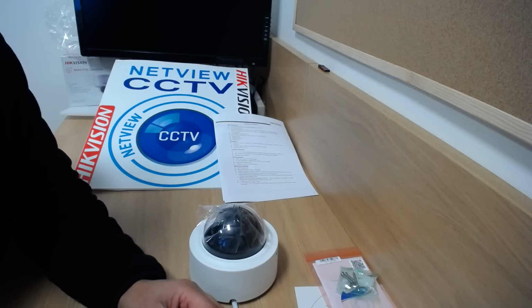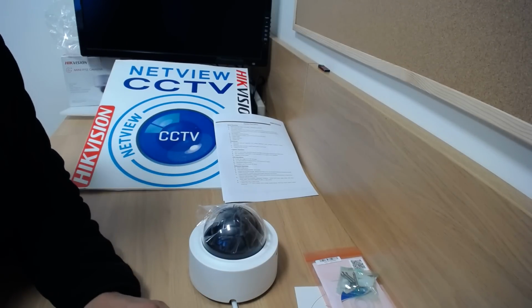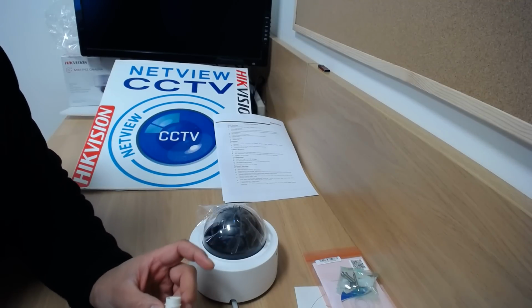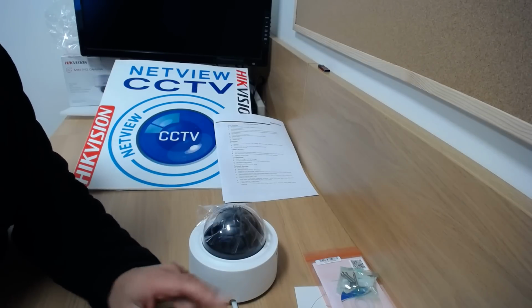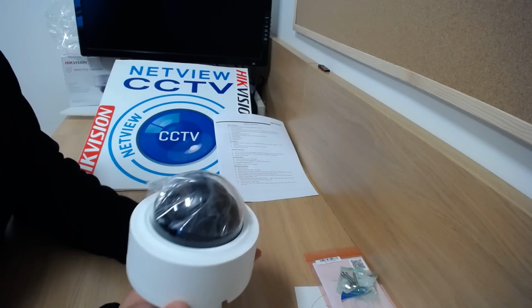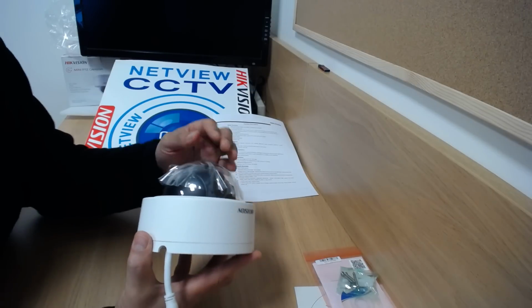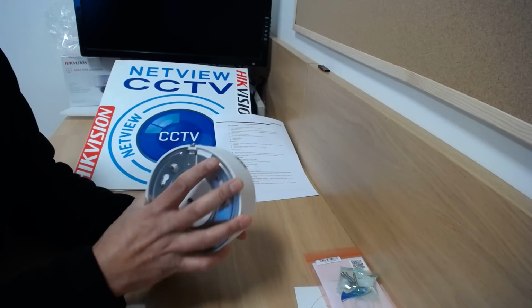And also a 12-volt power supply. The 12-volt power supply is if you don't use the PoE and just use the RJ45 for data. Connect, for example, into your network or into your router, then just power the camera separately with a 12-volt power supply, and that's all your connectors on the back. It is IP67 rated, so don't go opening the camera up itself. Keep it watertight. You've got the mounting bracket underneath.